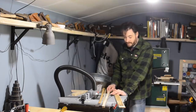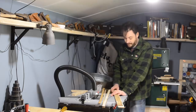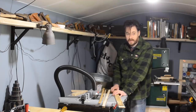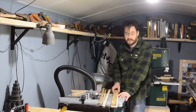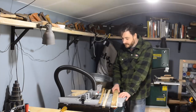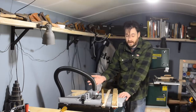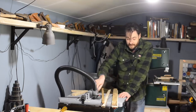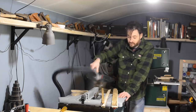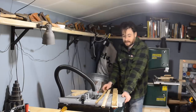Things I knew I wouldn't like before I bought it: the non-standard mitre slots, which is a huge bugbear for me — why can't they all be the same — and that it's going to be noisy. Everyone said the Dewalt would be horrendously noisy; this is probably on par with the Bosch I had, and when the Bosch was a great saw I just didn't want to get the same thing again. On the good side, I love how you adjust the riving knife. I've never used a blade guard because I always had to take it off for non-through cuts, but the fact that you can take it off so easily and adjust the riving knife so easily means I'm going to try my best to use it, which will help dust collection and help keep my fingers.